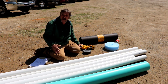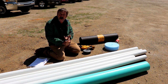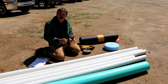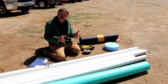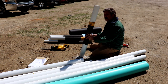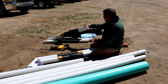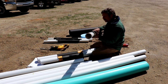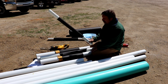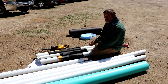Get out your Sawzall and start cutting those. Remember what we had: a toilet, a pedestal for that powder bath, 2 drops — those are gonna be 3 inches. We had that vent behind the washing machine and a kitchen sink — the vent and the kitchen sink are gonna be 2 inches. Here you go: I got my risers all cut up, got 2 drops, one for the toilet with foam on the inside, and then I've got my kitchen sink, my vent for that washing machine, and that pedestal sink. Now you can go lay these out.